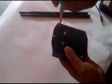To change channels, you have to open the box from behind like this. There are two screws holding the lid. Make sure you have powered down the machine and taken all static precautions before you touch the modules. Here are the channel switches. Strictly follow the rules shown on the screen to handle the audio-video modules.